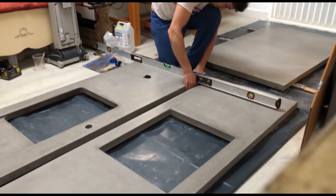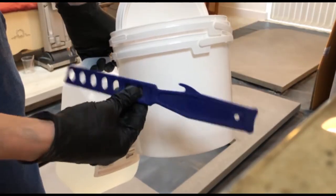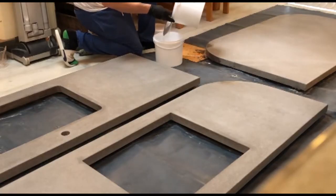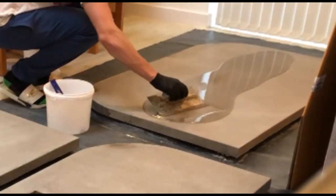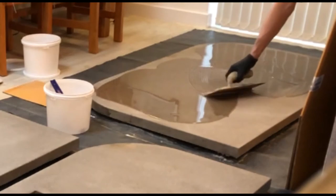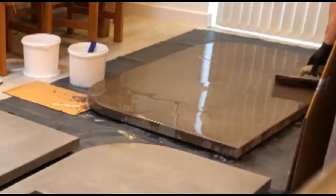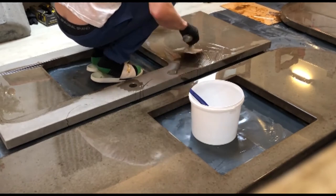Get a long spirit level and some shims to level the surface ready for pouring the epoxy. I'm using GlassCast 3, which is a UV stable, self-leveling and self-degassing epoxy. What that means is: when you stir it up and get bubbles from mixing, once you've poured it on the surface and spread it around with a tile adhesive spreader, the bubbles slowly rise and pop because there's an ingredient in the mixture that forces air out. It's got a 16 hour cure time so there's plenty of time for all those bubbles to escape, and when it's finished it gives a crystal clear completely flat surface. I've put a link in the description for this product and every other product used in this video.